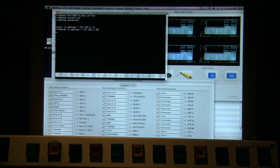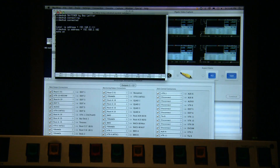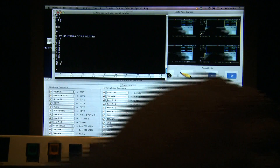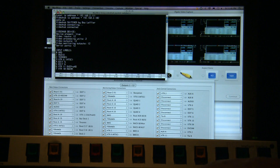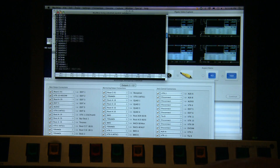When the unit is first turned on, it just displays the current IP addresses that it's connected to. If the item has echo selected, which is part of the setup procedure, when it turns on it will show you a display of all the parameters from the connected video hub. With those parameters you can scroll back on the terminal program and it shows you everything that the video hub has sent, which is used to configure the microcontroller. This information can be selected to display all the time, or you can just turn it off.